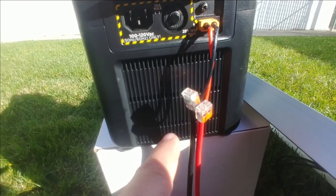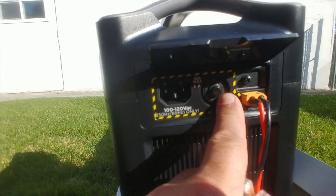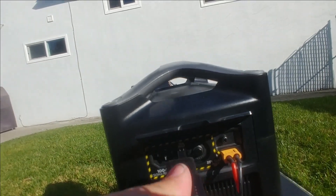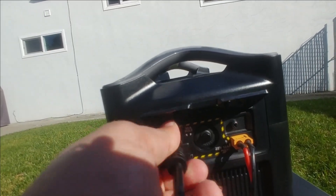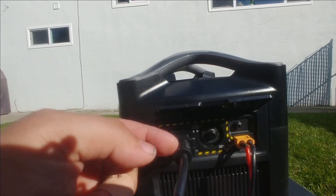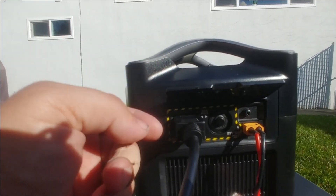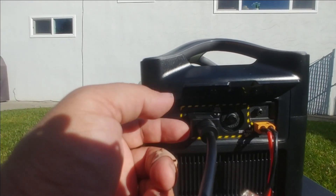I made my own wiring, however it does come with its own wires which you can plug in. We got a reset and the household electricity ports — so if you have a laptop and you don't want to lose any data, this can act like a UPS. When the power goes out from shore power, this will kick in. However, this will not work well for desktops — it will work better for a laptop because you will lose power for a 30th of a second, and that can actually get your computer turned off. So keep that in mind.